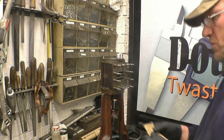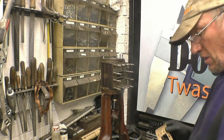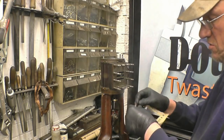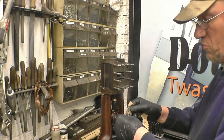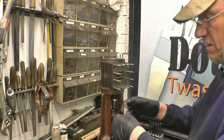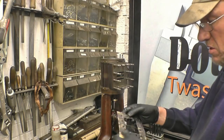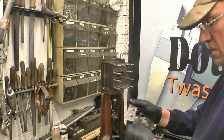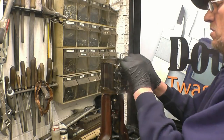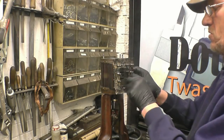I'm going to put the valve chest on now, as the gasket goes between this face and the valve chest. That's the gasket I made. In the olden days I used all kinds of evil preparations on gaskets — some horrible stuff. All I'm using now is a little bit of ordinary grease with some graphite flake mixed in. That'll be perfectly adequate, and it means you can take it apart without the gasket getting damaged. It's messy but it does the job.